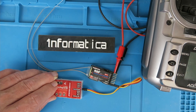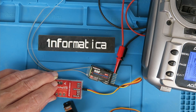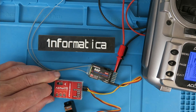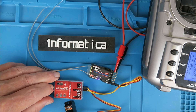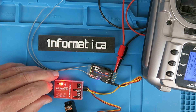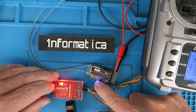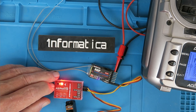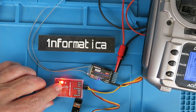Switching off and then turning on the transmitter — welcome to OpenTX. Connecting a test servo to channel 1 for ailerons and switching on. That was its gyro calibration routine; it's important not to move the receiver during that mode. The blue indicator on the RadioLink confirms it's in SBUS mode, and moving my aileron function we have control there.